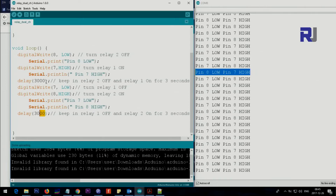You can play with the timing and configure it for your purpose and application. The load can be turned on and off based on temperature, a condition, or a switch — for example using an if condition: if some voltage is bigger than something or temperature is higher than a threshold, then turn it on or off. I have a separate video explaining a thermometer with a relay, and I'll put the link in the description.